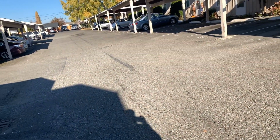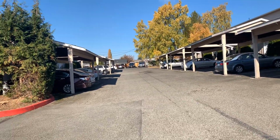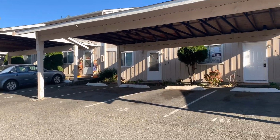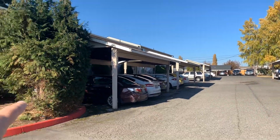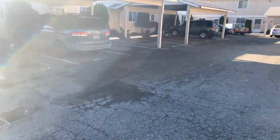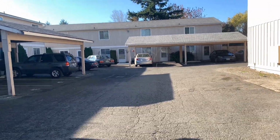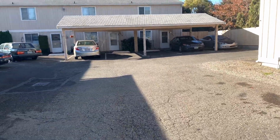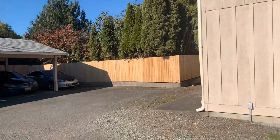So change of plan. On both lots, we're not going to remove the asphalt behind the wheel stops. We're going to remove all the asphalt in front of the wheel stops throughout the whole lot, both the north and the south lot. Make a saw cut through. That includes down here, all the way up to this concrete wall here.